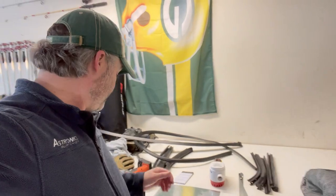Now, I was going to make this out of aluminum. That was the plan, but I couldn't source a thick enough piece of aluminum to be as sturdy as a piece of galvanized steel. I take that back. I could source a thick enough piece, but bending a thicker piece of aluminum weakens the aluminum, and I just want to make sure that there's no brittleness involved for vibration to cause the bilge pump just to fall off its mount. So I decided to go with the same gauge galvanized steel.